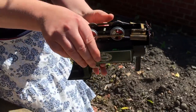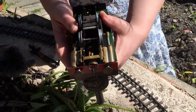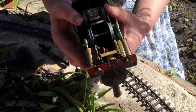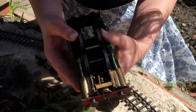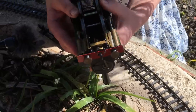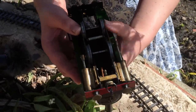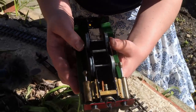I'm going to turn this over — I'm just trying to find a way of letting it dump its vinegar without spraying it everywhere. You'll see there it starts to come out of the funnel. So we manually just wind this over, and that's going to clean out the pipework, the cylinders, the piston heads. I'm just going to work it through. And I can already feel that the motion is turning over a lot freer and easier than it was before — just with the back pressure, it's working really nicely.